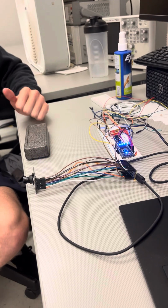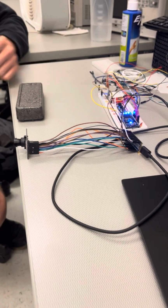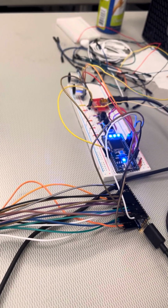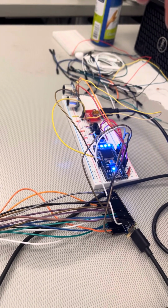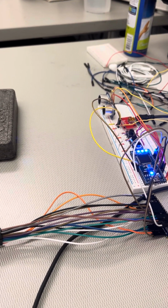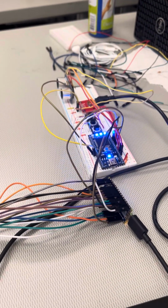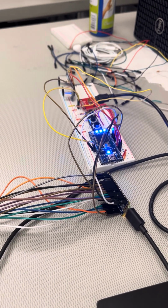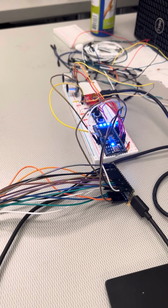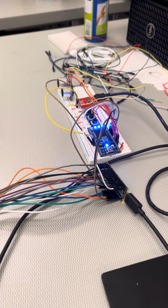Next, we take the predicted value out of the Nano BLE and we send it to the mbed. The setup is we have the ultrasonic sensor that we used in lab, and we subdivided the range from 6 to 18 centimeters into 4 zones. The middle 2 zones allow you to slowly either increase or decrease the value, kind of like a scroll wheel on a mouse. The outer 2 zones allow you to do it faster, about twice the speed.